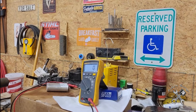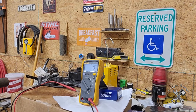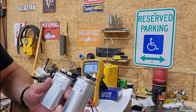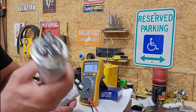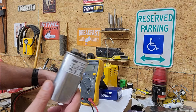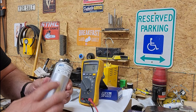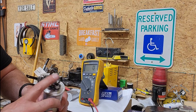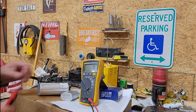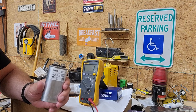Alright, these are the two basic types of capacitors you're gonna find around your house or in your shop. This is a dual and this is a single. This dual is mainly for the AC outdoor condensing unit - you've got your fan and you've got your compressor. My voice is terrible today. Anyway, this single is a 15 microfarad.